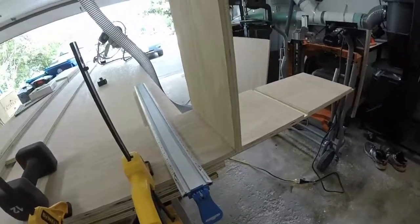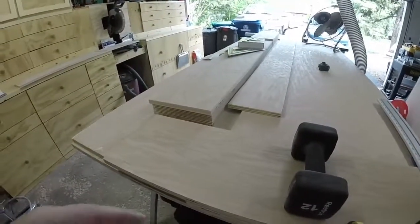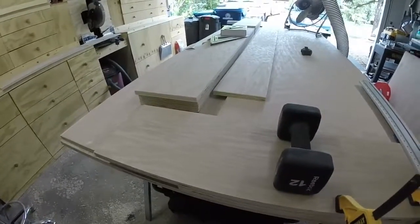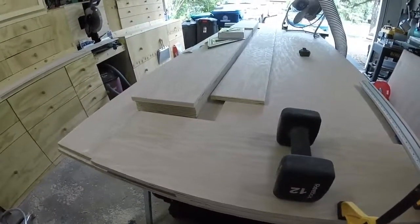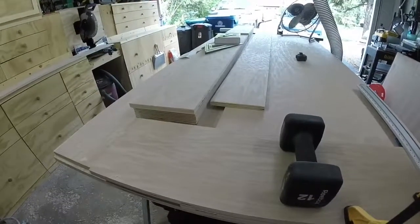I didn't do the shelf separators yet. But I need to edge band the good sides, so I'm using the glue-on edge banding, so I need to do that to all the pieces. I'm going to sand them first, edge band them, and then they're ready for stain.